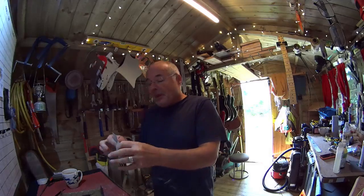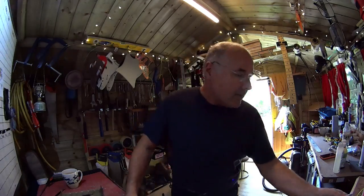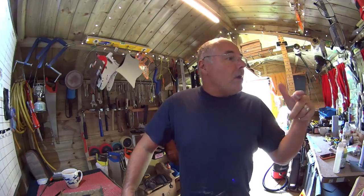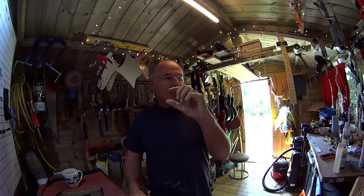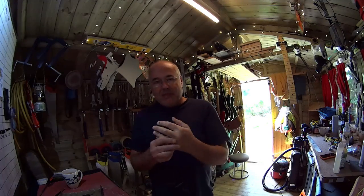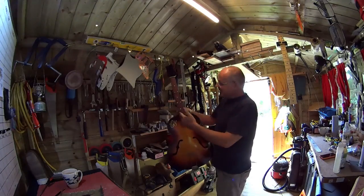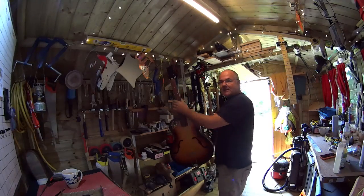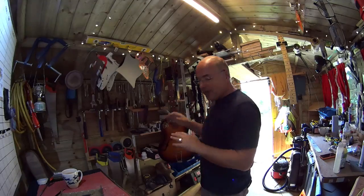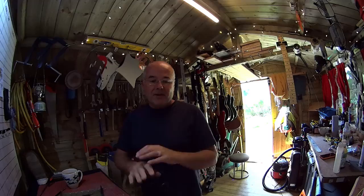If you can put that bit out of your mind, everything else makes sense, including getting the depth right and drilling the things out. I've thought about that point. If you've got a pillar drill with a very accurate depth gauge on it, you could use that. The problem with putting dot markers into an existing fingerboard: if you're refretting something like this, it's dead easy. You could drill those out or put whatever I want in there, and then of course you can re-radius those down to absolutely flush. It will flatten the dot and the glue around it, so you get a really flush result.